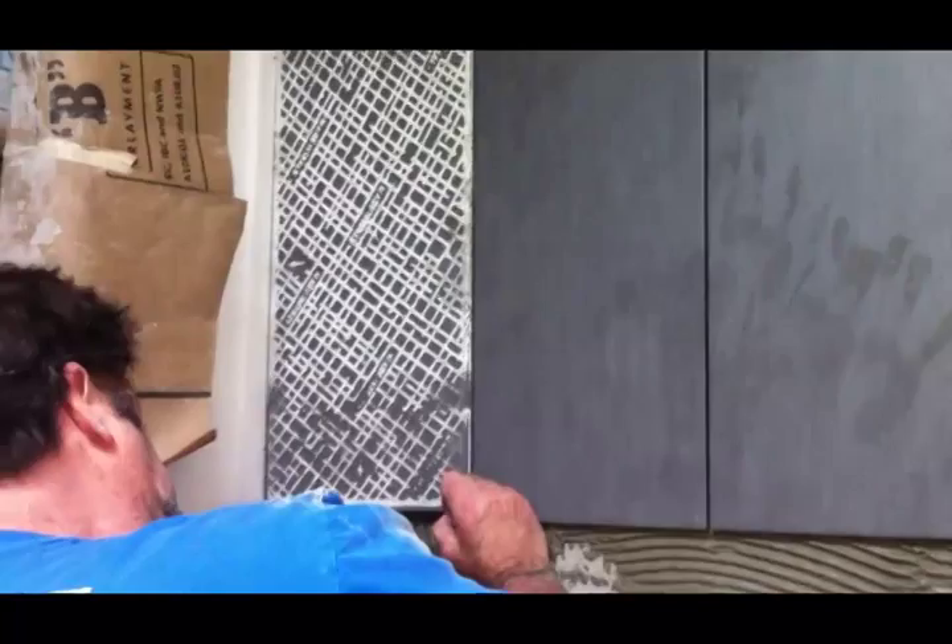Keep that first row straight with eighth-inch spacers and the rest of the floor goes in. Now I'll show you how to mark this cut — flip it over. This is a point-to-point because it's an angle cut. You just mark the top, then the bottom, flip it over, put an edge here and make a mark — there you go.